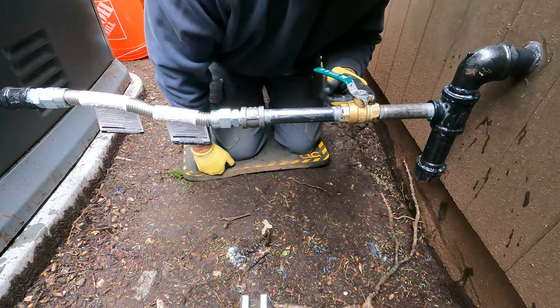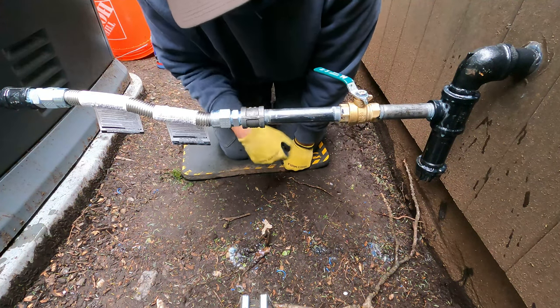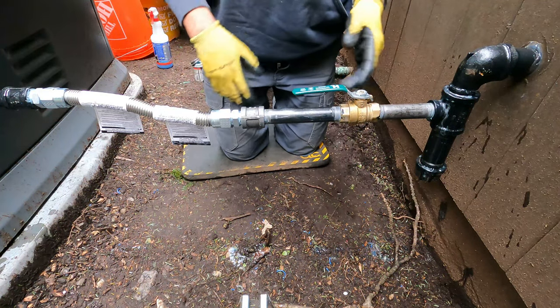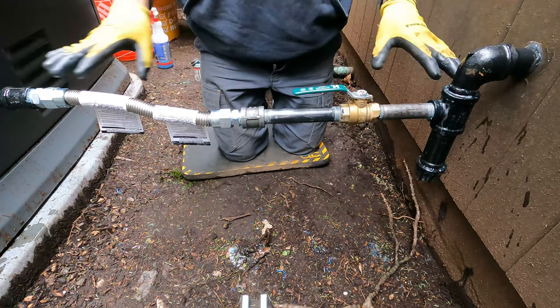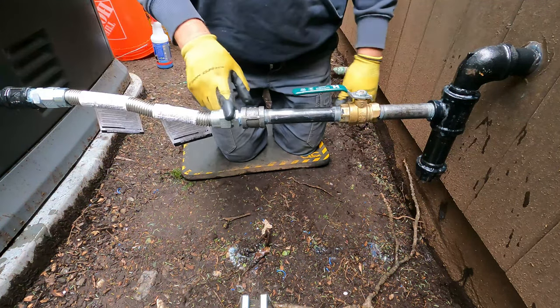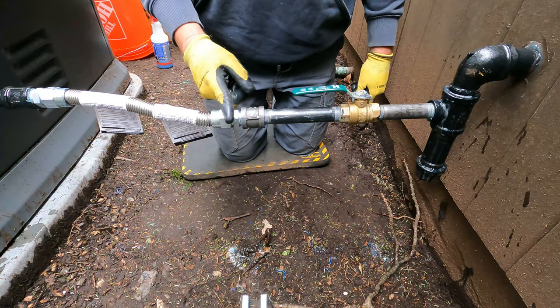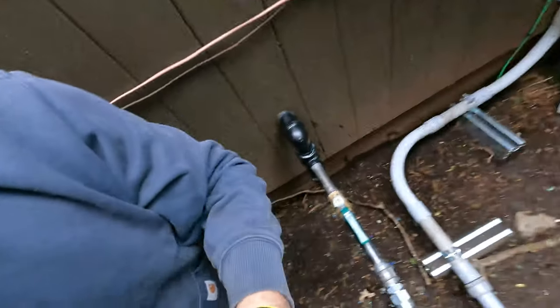The dope on the outside does nothing — the seal is in the threads. It lubricates the pipe as you're spinning it on, but the seal is good. Half open, full open — it doesn't matter, it still allows gas through. That's how to properly seal up a gas pipe and make sure it reaches the appliance. Remember: flares never need anything on the face. Some guys believe they do, but I've done so many flares and I've never leaked — it wasn't designed for sealant to go on the face. Spray on it — nothing is bubbling or foaming.